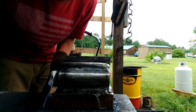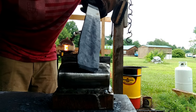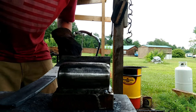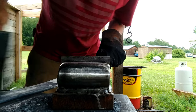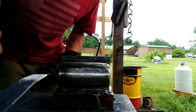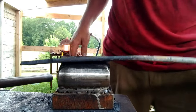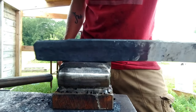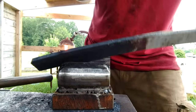This worked good. There's plenty deep enough to where I can, once it's done, go ahead and clean it up with the contact wheel on the grinder. We've got the fuller bead in here. Now we're going to let this cool, take it to the grinder, and test grinding it down to see how it's going to look — see if this is the way I should go.